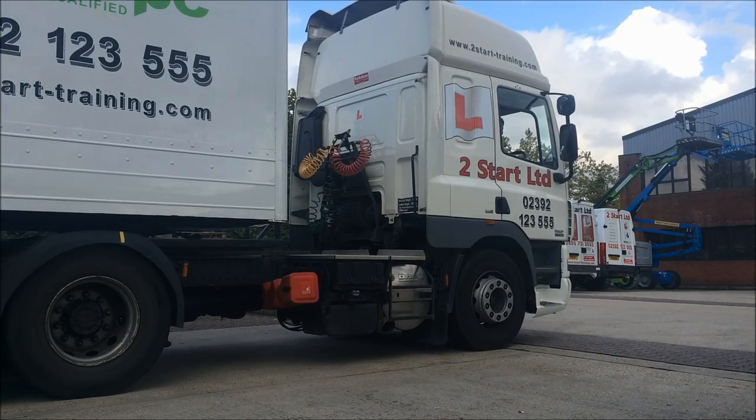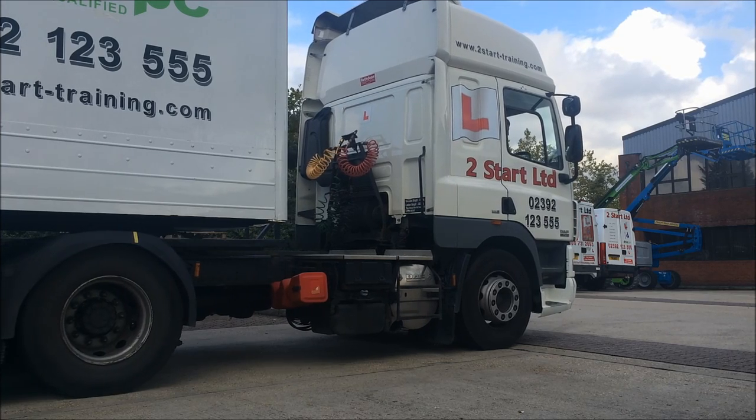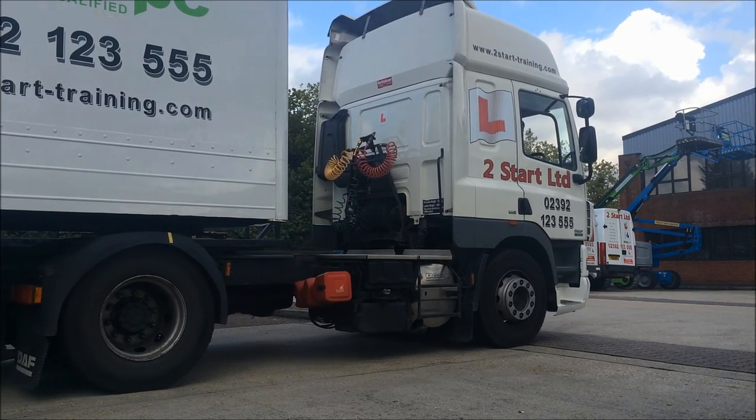The last thing we're going to do is to drive slowly forward, making sure that we stop just at the edge of that trailer to allow the rear air suspension on the tractor unit to settle down. You can see the fifth wheel and the kingpin there separating — it's important to stay underneath and have a look in the mirrors to watch the trailer and the tractor separate.